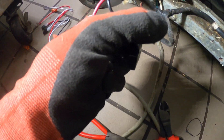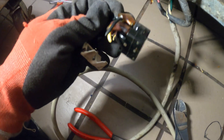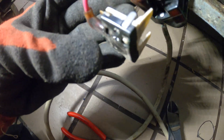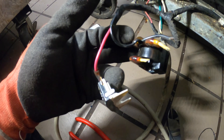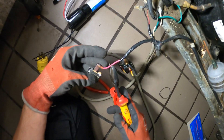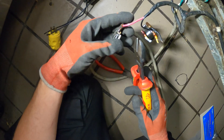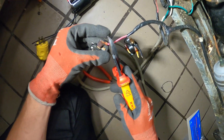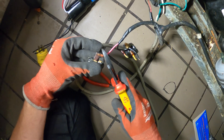It's actually three wires that I cut here — one, two, and three — those are cut. We'll incorporate them after if needed. This is a really tricky-looking one, but these two should be our power wires. The top one is definitely our common, which goes in — so this must also be an overload incorporated there. Let's cut that.